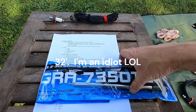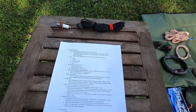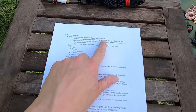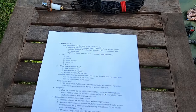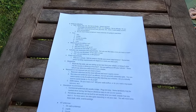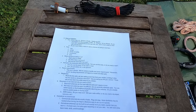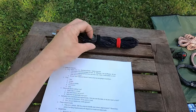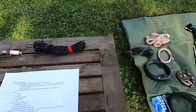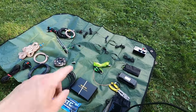These verticals are going to be fairly high-Q. A loop is going to be the highest Q — you touch that knob a tiny bit and you've gone from a 1:1 SWR to a 5:1 SWR because you sneezed on it. Efficiency is something else we need to consider — some of these antennas are much more efficient than others. Resonant antennas are always going to be the most efficient. This NFED is resonant on 40, 20, 15, and it'll work on 10. That dipole is resonant on 20 meters. That link dipole is resonant on 20, 30, and 40 meters.